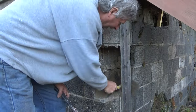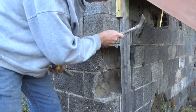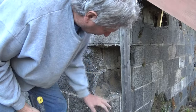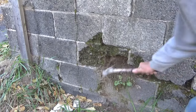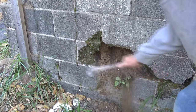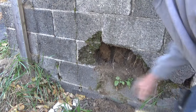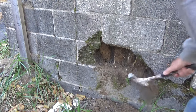That's it. Then we're gonna plaster the whole thing. As we go, I'll explain it to you. We're not gonna be getting no trophies here. See, a lot of that's still solid. If it ain't moving, we're not gonna touch it. Same thing here. Just the loose stuff we're gonna get. We're gonna fill it in. Looks like they filled this with sand. I don't know. We're not gonna make a big deal out of it though. Just gonna get it out, wash it out, that's it.